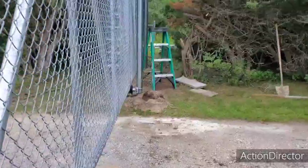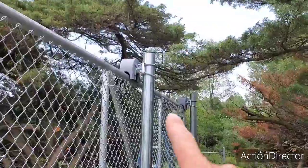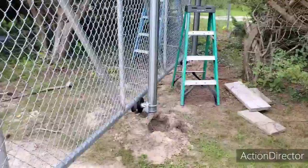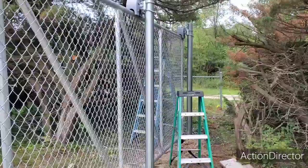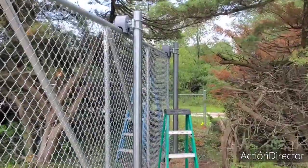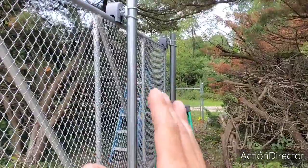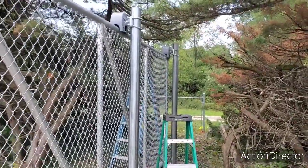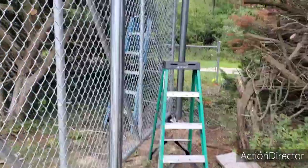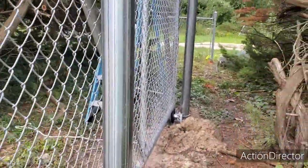Some things I've learned over the years — I can already tell this isn't completely done, so forgive the U-bolts. Bigger pipe, the more solid everything is. I wish this had six-inch post on it. I should put some bracing across here, but I can tell they're shuddering. I even filled the pipes with concrete to do an experiment — they're full of concrete — and it's just not enough.